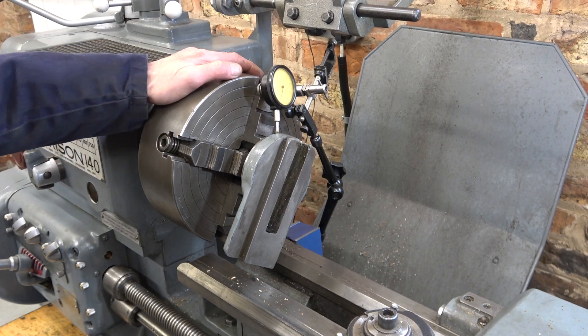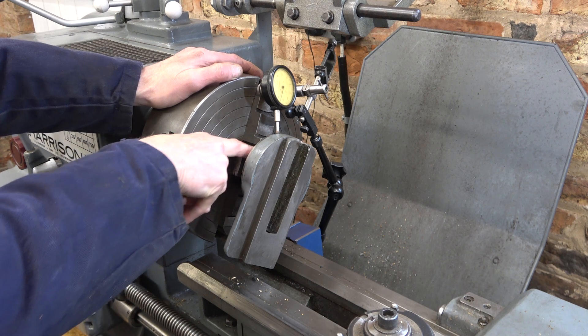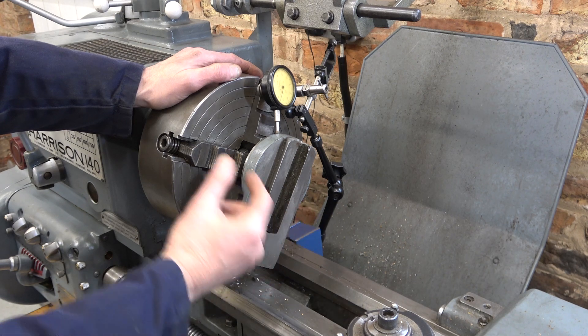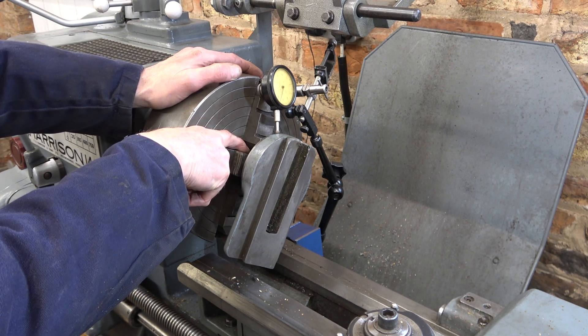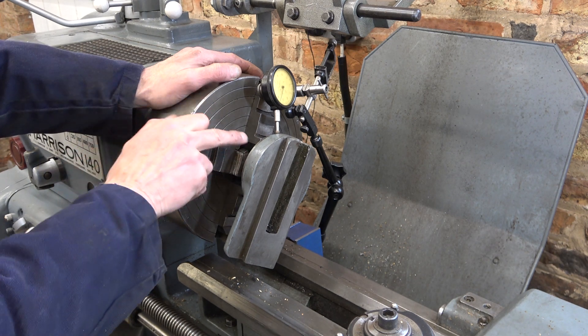I'm pleased to tell you I didn't wind myself into the lathe while trying to polish this spigot. But having tried it in the ram, it's still too tight. I could feel with my fingers that it was running oval in the lathe — this front part of the peg is quite lumpy. So I'm going to have another go and see if I can machine this peg properly.